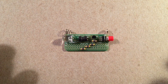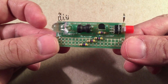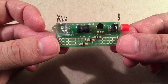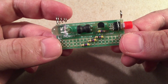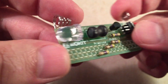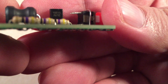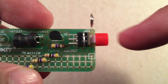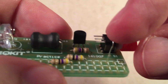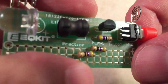I also practiced with the three extra resistors provided in the practice area — I had a good time with that. So here's the finished kit. Ta-da! This is a great second kit. You guys just finished your Elenco Learn to Solder kit — why not pick one of these up? Two bucks from China, or a two-pack for 10 bucks off Amazon. There's the LED on the front, the inductor here, and the YX8115 transistor IC — that's the LED driver. Here's the resistor in circuit, and those three are just for practice. The switch has six terminals: three you don't use and three you do. Laying it on its side, you have to use a piece of bus wire or component leg to anchor it in place.